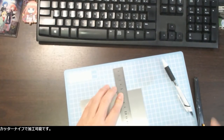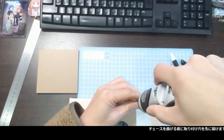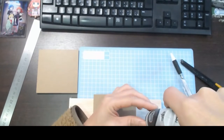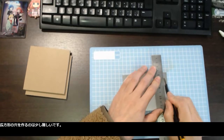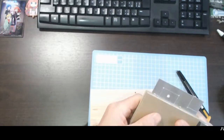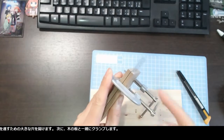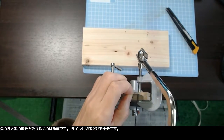It is craftable with a cutter knife. I made the mounting holes before bending the chassis — a hand drill can do those for bolts. Making rectangle holes is a bit tricky. I learned this method from YouTube: the edges are half-cut by cutter knife, small holes are drilled at the corners with a hand drill, then a bigger hole is made for putting a handy scroll saw through. The plate is clamped with wooden planks, and removing the rectangle piece at a corner is easy — just cutting a line to the inner corner.